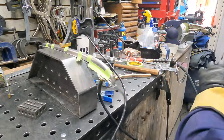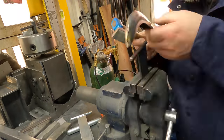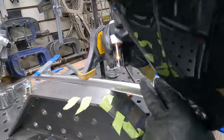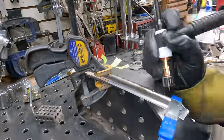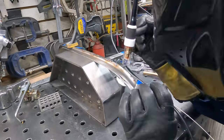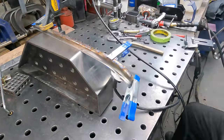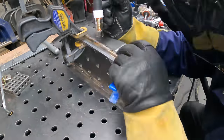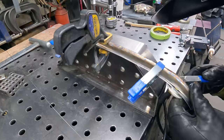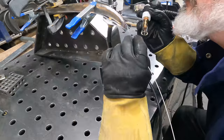Welding this stuff up is not easy if you're not seasoned at it. Just getting it tacked requires near-perfect fit-up. I laid in the first couple of tacks then dollied out the lines all the way along the back to make sure everything was as perfect as possible. You can see the back-purge line I've installed — I created a solid piece out of thick aluminum with a diffuser in it to get a back purge. Back-purging stainless doesn't matter — yes it's trim, but back-purge stainless is just best practice. I lay in tacks about every half inch, then go through laying in very small stringers along the way with 0.035 wire, which is hard to do. At the end, that's the inside — shaping the final part next.